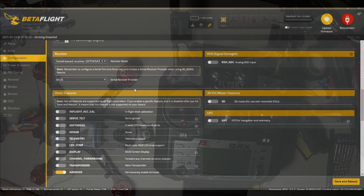Craft name, FPV camera angle. Here's where we choose S-Bus, then I-Bus for our controller receiver — and that will give us FlySky. On some other flight boards there is a jumper you need to solder in order to choose S-Bus or I-Bus as the default — it's just a matter of bridging two little pads on the motherboard — but this one doesn't have that.